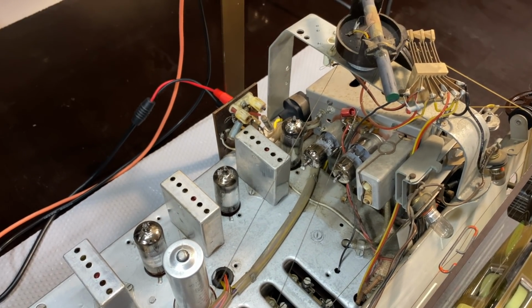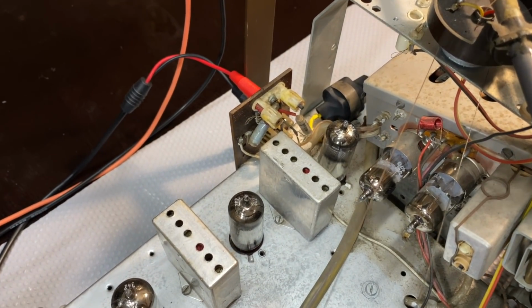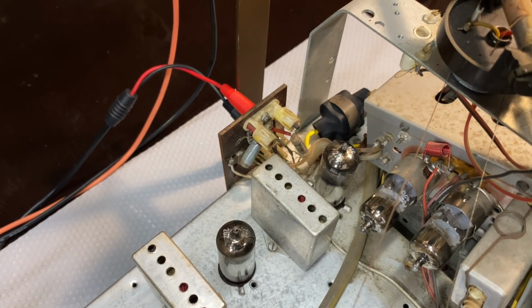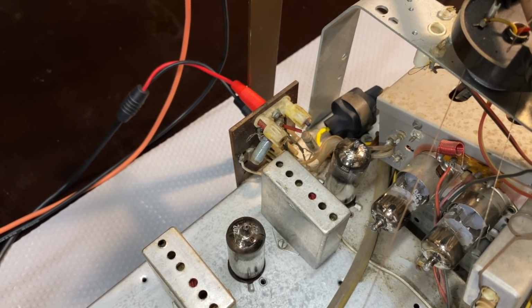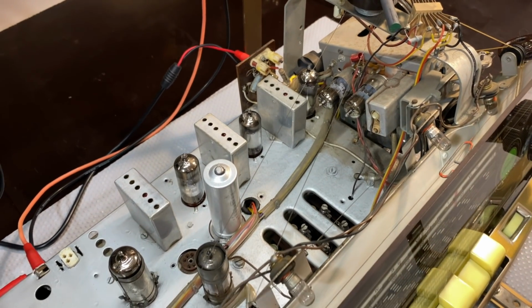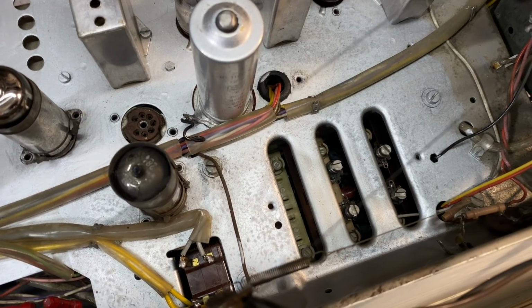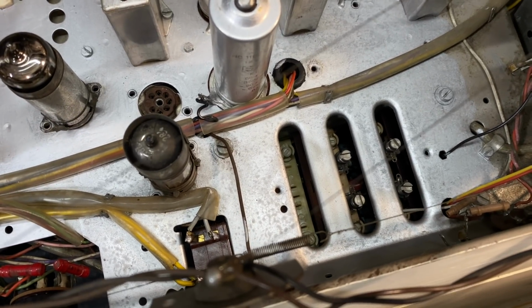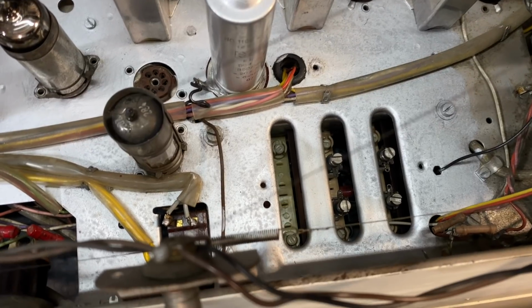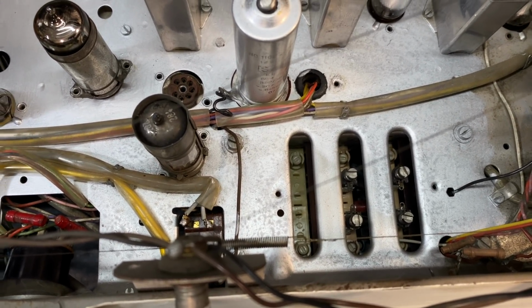What happened is I ramped up the level of the signal generator quite high, and I don't hear anything. So the trap is pretty good. So I left it alone. And now we're going to do the next step, which is the RF alignment for the various AM bands. Now all the adjustments we need for the RF alignment are in those 3 gaps you see over there. And it comes with a little cap on top.